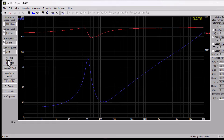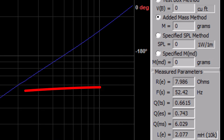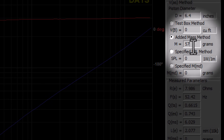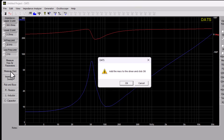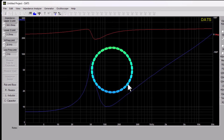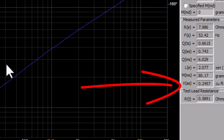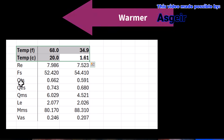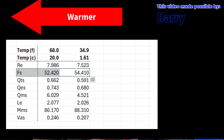Now I'm all set up in the house and the temperature inside is 68 degrees Fahrenheit. As soon as you run a sweep, you can see the difference. The free air resonance has dropped by two Hertz. Let's add mass and check the VAS. It's gone up to 0.25 — so a fourth of a cubic foot. There's a myth floating around on the internet that the VAS is the maximum size of your enclosure — that is incorrect. This is a measure of the subwoofer's compliance. A bigger number implies a softer suspension. And here, as the subwoofer warmed up, the suspension parts softened up and the VAS increased.